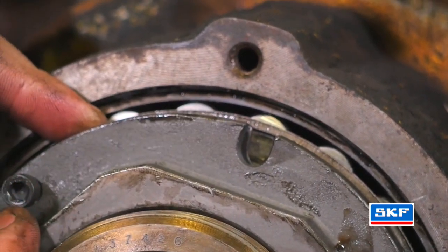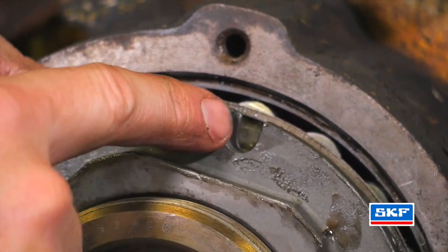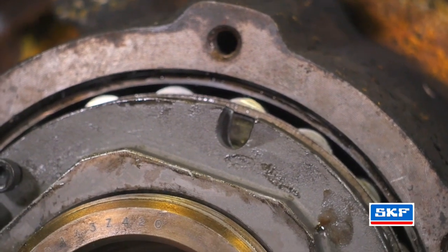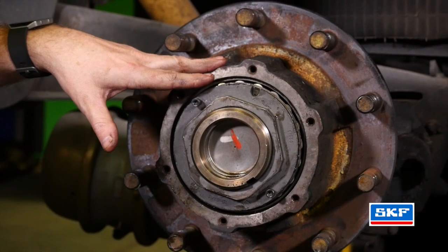Verify proper and improper alignment of the set screws. Once you have properly aligned it, set your set screws to no more than 43 foot-pounds. After your adjustment is completed, verify your end play with a dial indicator.